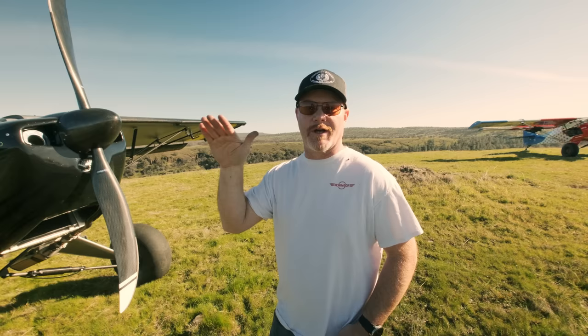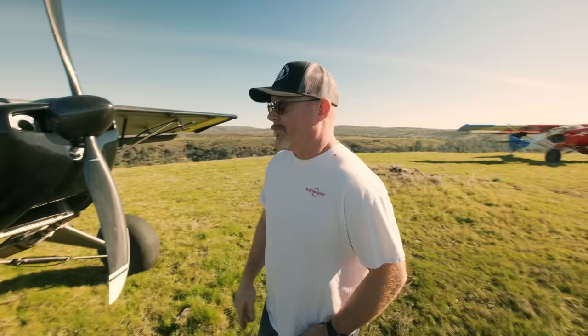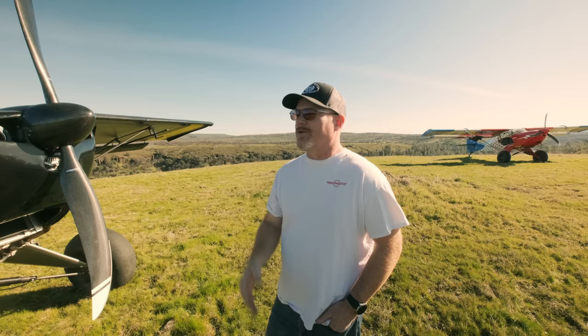And I had a Model 5 with a Lycoming on it, and I thought it was a result of that big, heavy engine. I just thought it was a characteristic of that plane. So I was really surprised to see it with this one, because when I finished it, it came in at about 828. Yeah. It's pretty good. That's for what I outfitted it with. And so I was surprised to still see that characteristic. And with this wing, it doesn't do it at all. You're flat, almost not even a 1 degree nose down. And so it does, like you said, feel happier flying along like that.